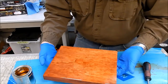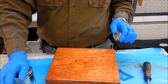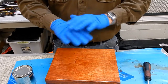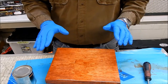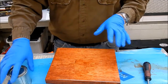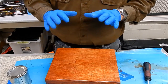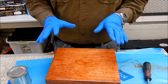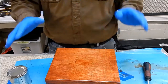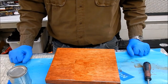You just do successive coats. If you don't have the furring/fuzzy problem that this wood has and you're using regular veneer or veneer plywood, you shouldn't have this problem. I usually do three or four coats. Follow the directions - put it on, let it sit for a few hours or overnight, then lightly go over it with your 220 or 320 grit sandpaper, use a tack rag to take the dust off, put another coat on. Keep doing that, and then your final top coat you just do the top coat and leave it.